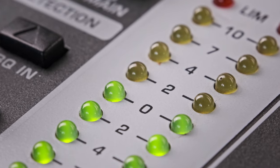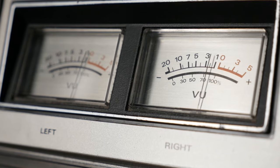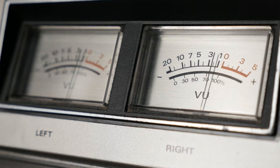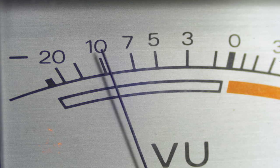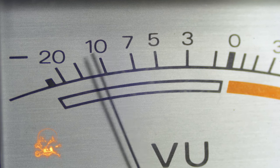Something that often gets pirate radio broadcasters exposed is that the audio is not limited, so it can easily over-deviate, which will be detected very quickly. This is because even for a licensed broadcaster, over-deviating is illegal. So without a limiter, you are likely to over-deviate unless you play your audio very low. But this then also becomes obvious because licensed radio stations don't tend to under-deviate either.